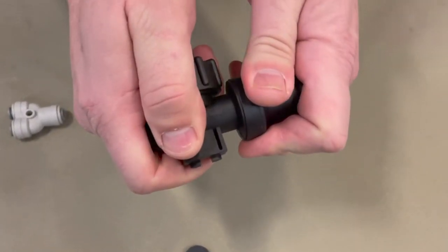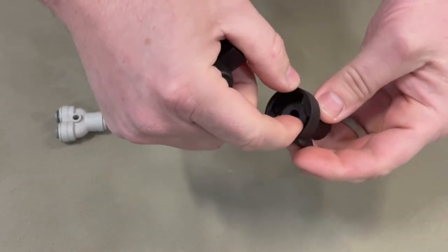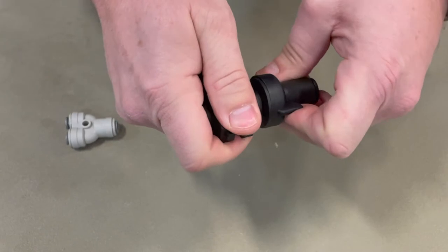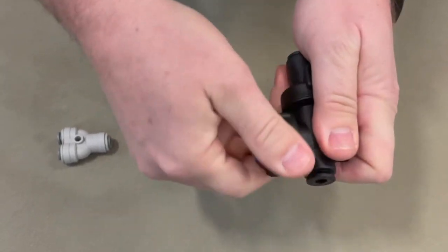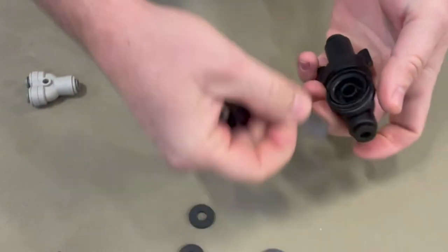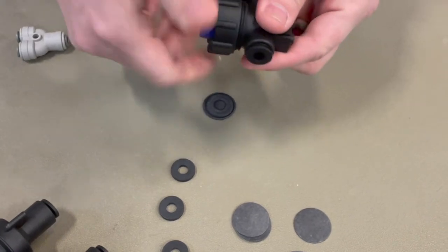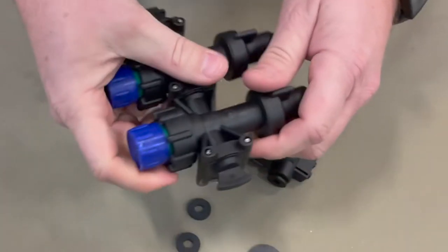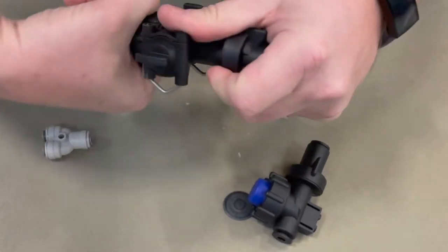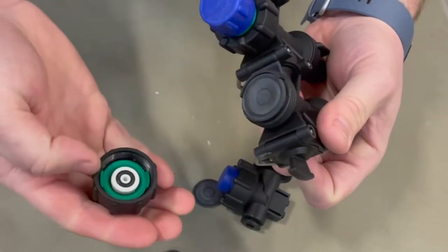Next, look at all your check valves on your system. Take those apart and check the O-ring inside the cap — those wear out and typically people replace them every one or two years. Also check the diaphragm on the side of the check valve. These two items are the most sold items at Surefire, so consider replacing them every first or second year. The same applies to the dual check valve — same O-ring in the bottom and same gasket diaphragm in the top. Visually inspect those and make sure they lay flat and aren't wrinkled.